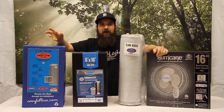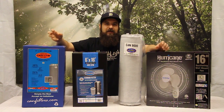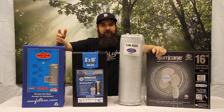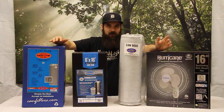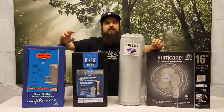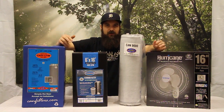When smell and odor molecules come into the filter, when they're hotter they have more energy, and more energy means it's harder for that carbon to grab them as they move through. On top of that, humidity actually coats carbon, so if you have a large spill in your room or you just watered heavily, you might notice that your carbon filter is not working as well. It's because the humidity coats that carbon and makes it harder to grab those odor molecules, those volatile oils, those aerosols.